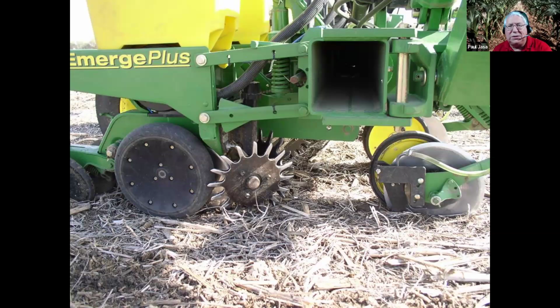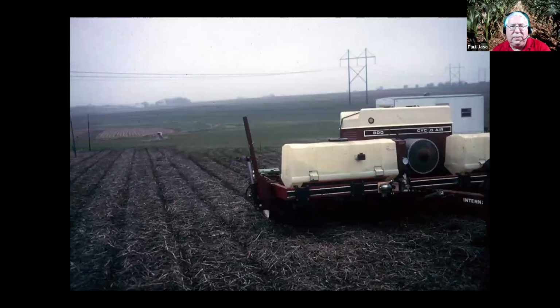He's got a starter attachment out front to put down nitrogen. And again, it's to avoid the carbon penalty when it comes to high carbon cover crops or, say, planting into corn or wheat stubble, or grain sorghum residue where you need some extra starter nitrogen. Then he's also got a little blue line hiding in there to get some starter down in furrow. But again, we got to think about how the system all fits together.